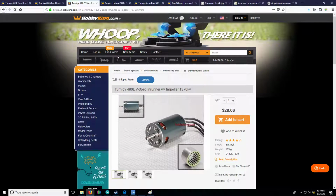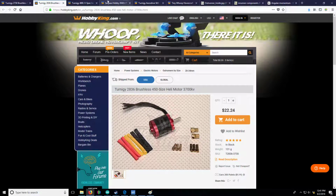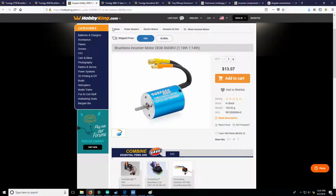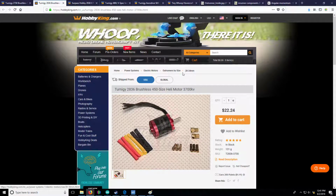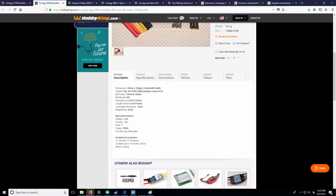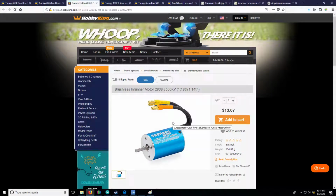It's just that, but even if you have the same size Inrunner and Outrunner, you're still going to have the benefit of the snappiness of the Inrunner. So even though this has the same exact KV as this guy, the Inrunner is going to still have a lot more snappiness to it. So if you're running something like an EDF, or you have really, really high load, the Inrunner is probably better for an EDF than the Outrunner. The Outrunner is going to have similar size and torque, a similar RPM, as well as torque here, as you can see, a little bit more torque, same exact RPM, but a little bit more torque, because that's what equates to the extra difference in wattage. But the Inrunner is going to be snappier on increasing its speed, its RPM. So you're going to have more angular acceleration on an Inrunner than an Outrunner.